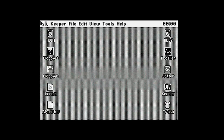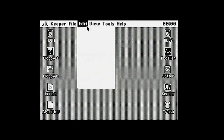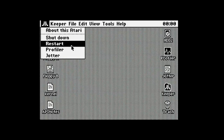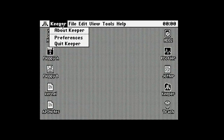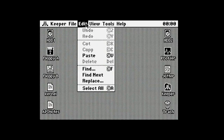Let's have a little play with this. It's sufficiently quick that, as a matter of urgency, this needs a control panel to slow the mouse down. It's with the acceleration on. If the software acceleration wasn't on in the kernel, it's in the mouse driver itself, it would be about right, but it's a sustained movement for so many frames, and it starts to accelerate, and it's very, very quick. It's too quick, but that's not the fault of the TK2. That's because we can't configure the acceleration.